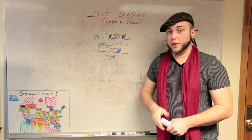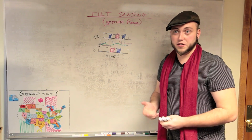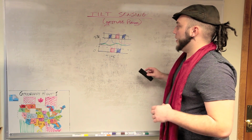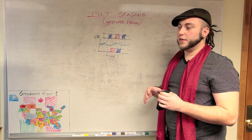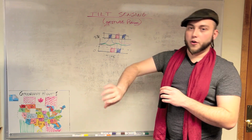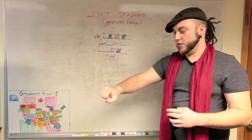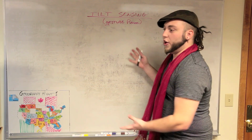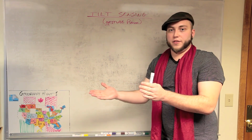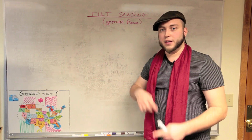And then all you're doing is comparing one array to another one. As long as your data is really low resolution and you're not trying to capture a really fancy gesture, it doesn't take long to do those comparisons. The way I handled it in my program was like this, except instead of trying to do these long strings of gestures, I wanted some really quick gestures that you could just do in the middle of a game, and you're not sitting there trying to figure it out, and then when it doesn't work, you get all mad and you're trying to do it again, and it doesn't work. In my code, I just looked for one really extreme motion. And if it's an extreme positive on the y-axis, it goes, hey, he's probably looking to switch weapons, and it goes into that subroutine, switches the weapon, and dumps back into the main loop.